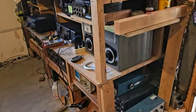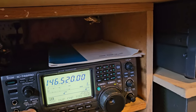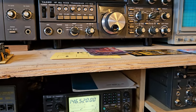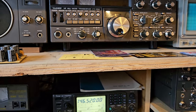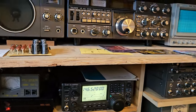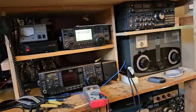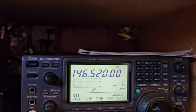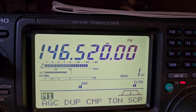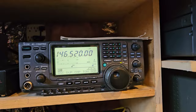Over here we've got a dedicated 2-meter setup — it's not hooked to HF, it's dedicated 2-meter in. It's 100 watts. With my beam I have a really good match, but with my vertical — a Diamond CP22 stacked 5/8-wave — it doesn't want to match. It doesn't have a good SWR except for low in the band; it really likes 144. But you get up into the FM simplex and above that, the radio starts to fold back power. As far as I understand, this radio has an active SWR meter on two meters. When we look here, we can see a little bit of reflection, and we're not putting out 100% even with RF power all the way up.